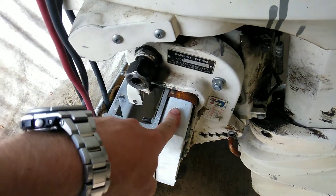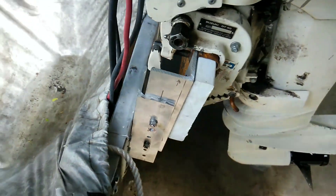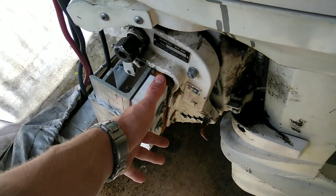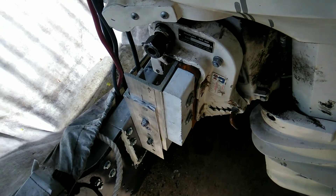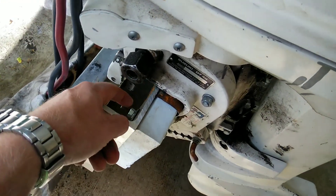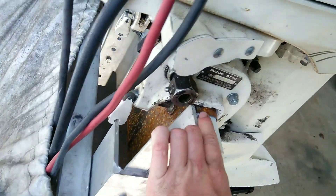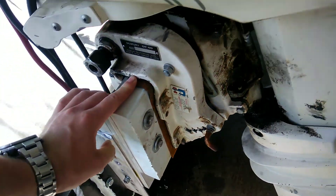As far as the wood I used, it's the same thickness as the transom — actually a piece left over from making the new transom. I did the same thing: coated it in a rubber coating-type material and used silicone caulking on all the bolt holes. I had a piece of 22-gauge steel sitting around, so I used that as a little bit of reinforcement for the transom.